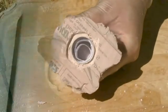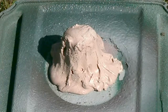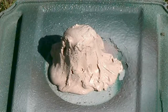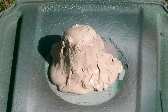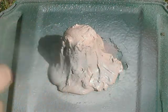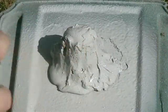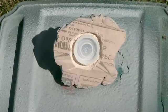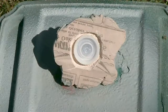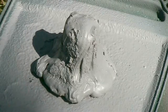I already got the log book inside. Get yourself some gray primer and spray it down. This is about 15 minutes after we poured it. It's still very warm, but that primer paint dries extremely quick when it's like this. Let's give it a quick coat, all the way around. This primer is going to stick to the Bondo like glue, makes a really good base, and it also seals it. After the top is dry with the primer, also do the bottom.